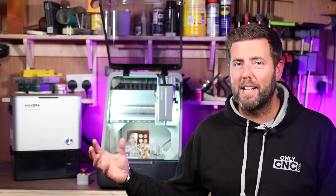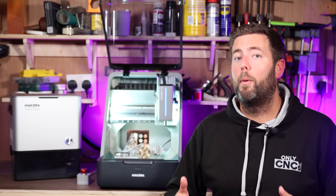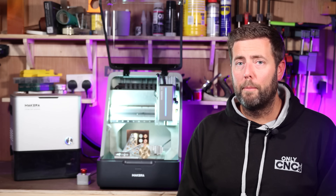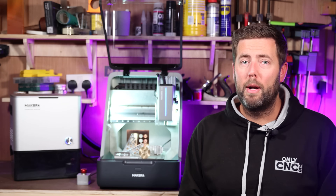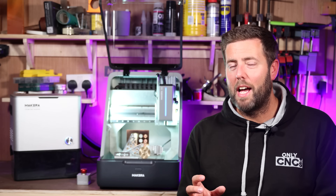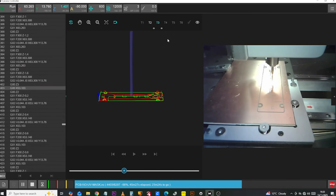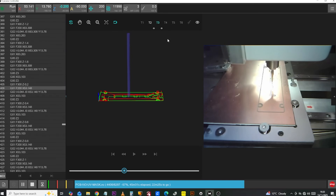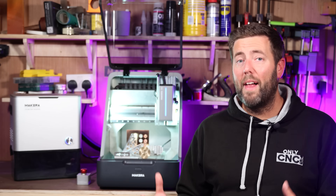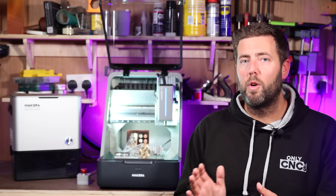In terms of the Makera CAD/CAM software, this is free with the machine so you don't have to pay for it. I'm not really showing it in this video because they haven't released the new update yet — I may feature that in a third video. Their own software is free, and the most common CAD/CAM software out there will also be able to generate files this machine can run. As a caveat though, to actually run the CNC machine itself — in terms of control software — that does have to be done through Makera's own software. The reason is it is designed to connect directly to that, and all the fancy features such as auto leveling and auto Z probing come from the control software itself. But again, it is free and comes with the machine.